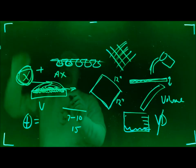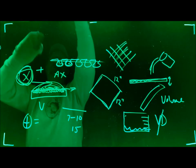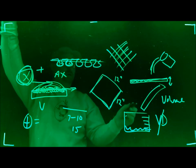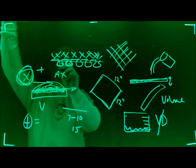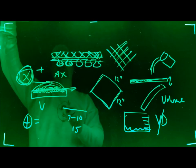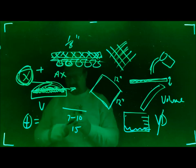It was just too slow, and also it was a screen size issue. That meant you had to screen to a certain mesh, so you were really relying on the expanded metal above this to capture all your nuggets, of course, and that expanded metal was slowing down the flow and the action of the vortex mat below, and it just wasn't a good combination. But by itself, you couldn't catch nuggets because we were at an eighth inch, you had to be at process size, and we do have a few nuggets in our area.